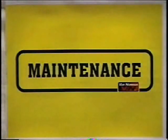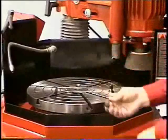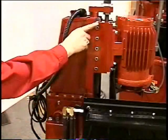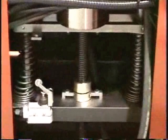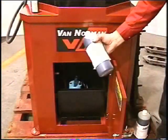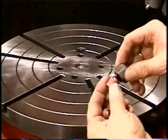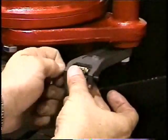Maintenance on your machine. The table oil should be checked on a regular basis using the dipstick provided — approximately once a week should be sufficient. The column on the FG5000 and FG10000 is automatically lubricated by keeping the rear oil reservoir filled. The FG4000 has 4 cups to lubricate the dovetail ways, and this should be looked at weekly. Lead screw and nut assemblies should be lubricated every 3 months with the lube provided. The coolant will require periodic cleaning and refilling approximately once a week depending on how much you use the machine. The easy lock insert will only need replacing when the old one wears out or is stripped. The tool provided is the proper method of replacement.